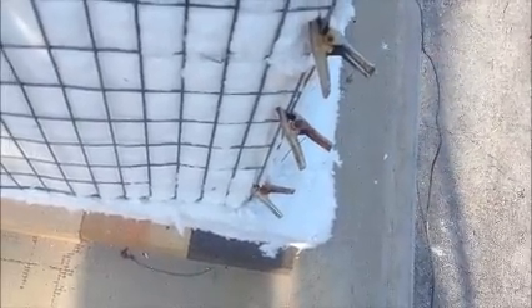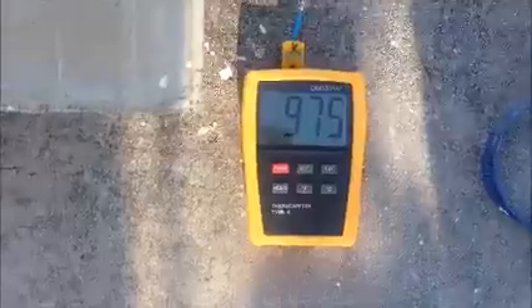I should mention a little bit about the kiln construction. It's a flat-pack kiln — I'll publish the website where you can see how it's made. Basically it's just hog wire: two-foot by two-foot squares of hog wire with little wire staples holding two-inch fiber to the hog wire. It's six pieces assembled using 49-cent wire clips from Walmart. The most expensive part was the fiber — about $110. The second most expensive thing was this little digital pyrometer; I got the pyrometer and the K-type thermocouple off eBay for about $50.